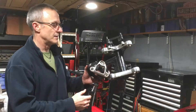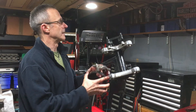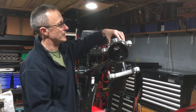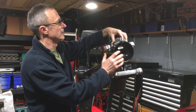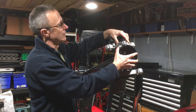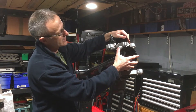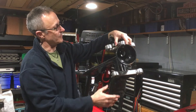I've modified the stock headlamp mount position on this bike in a couple of ways. The first thing I did was to trim off the shroud, leaving just the basic clamp. The stock position mounts on top of the tree top yoke, which works well, but I wanted something a little bit lower profile — under here. The thing is you can't actually mount it under there because it doesn't fit, so you've got to mount it just below and space it so it will sit there. That's more the look I wanted.